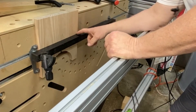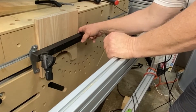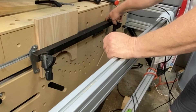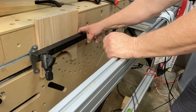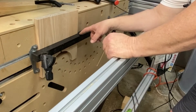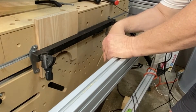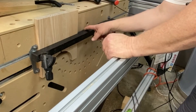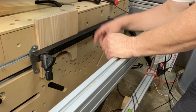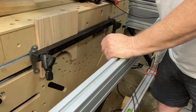If you want to make it even tighter or more secure, get like 320 PSA sandpaper and stick it to the back of this bar. You could also put it on the front, but I think the back of the bar is fine. Or get some crubber — it's like a cork rubber — and glue it on the back so when it clamps it has even more grip. Right now this is nice and smooth, and it's always worked in the past.